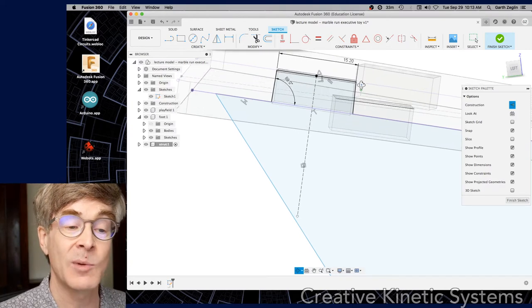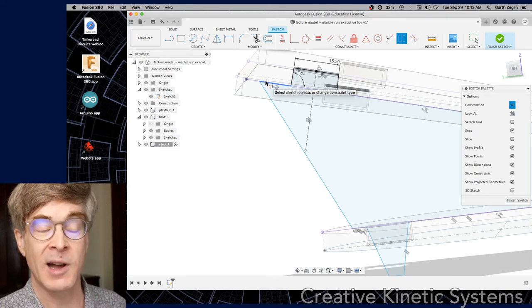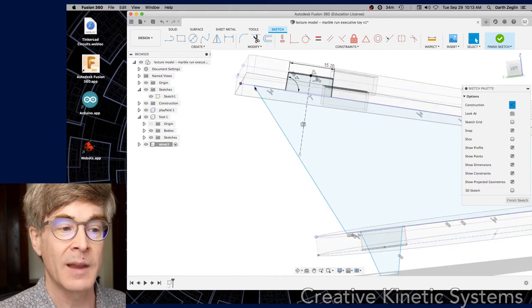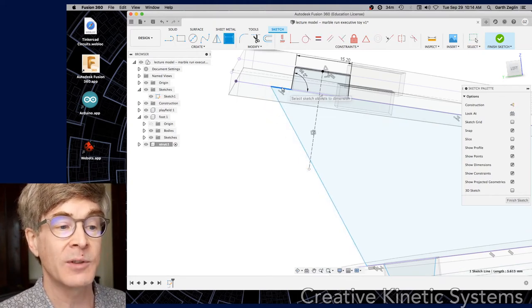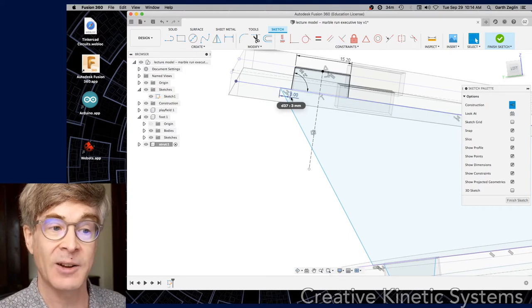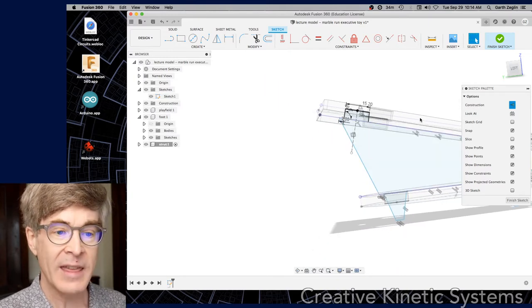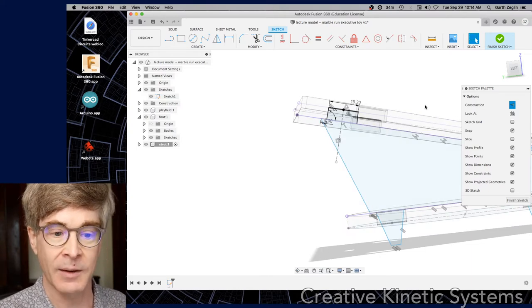What we'll see is it will slightly intersect the 3D model of the other part — I'm basically anticipating the fact that one will cut undersize, one will cut oversize, and pounded together they'll fit nicely. That comes from experience with the material. The CAD system will show you exact 3D shapes even if they don't quite reflect the final reality. Finally, I'm going to choose a length for this shoulder — just 3mm — to make sure it doesn't vanish by mistake. That gives a little bit to pound into and guarantees I have some face there. I'm likely to edit out a bit here just to save time, as you don't need to see me repeat the same thing three more times.